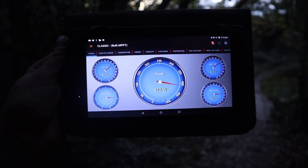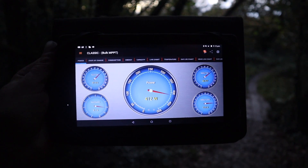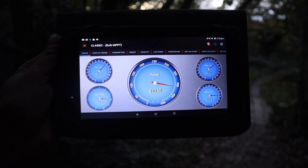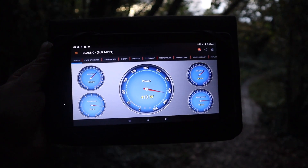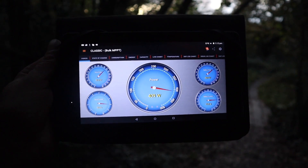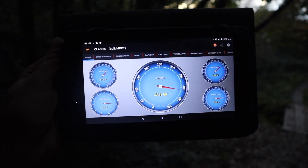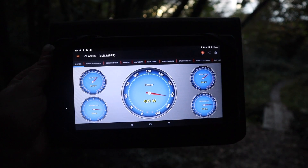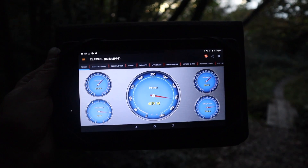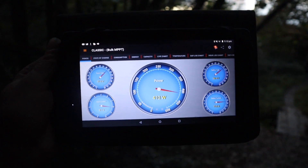I think we're back in business. We're up at 410 to 412 watts but that's on three nozzles. I was only getting 430 on all nozzles before, so we've still got another nozzle which is good for about 110 watts. Adding a bit of pipe friction in there, we should see our full power again. I think we fixed it, but I need to wait for more rain to be sure. We've got another 1.2 to 1.5 litres per second nozzle to turn on yet, so we should see close to 500 watts which is what we want.